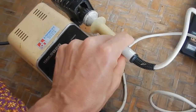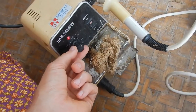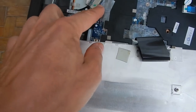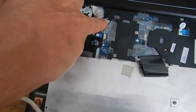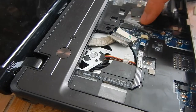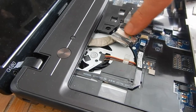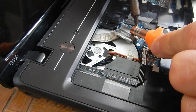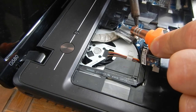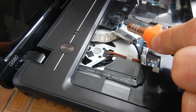I have the soldering iron. I'm not sure about the temperature — not too hot. Maybe start with 400 degrees. Just try to solder on the connectors here and then push on top of that one at the same time. There's this little plastic flap — I just taped it here so I have this area free. I apply pretty hard pressure.